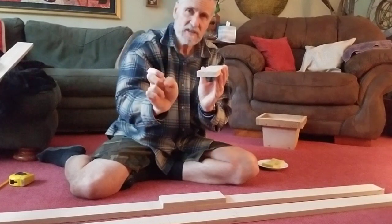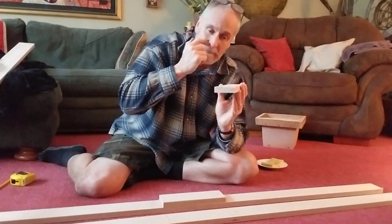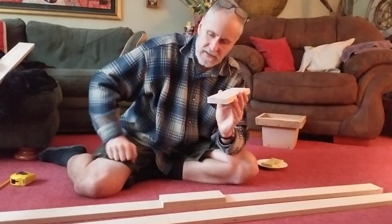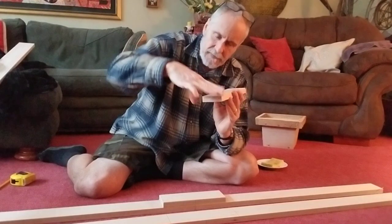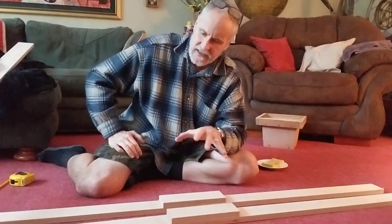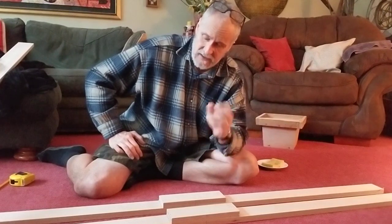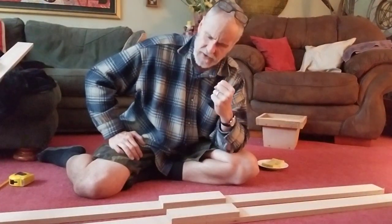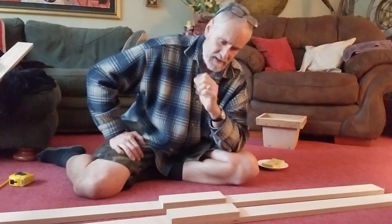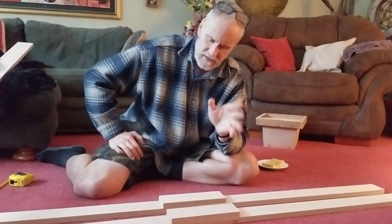For a bow that has great changes in widths — and I'm going to talk about the talisman I owe somebody — it's a little too high in the angle for that. But you could cover up a lot of differences in growth rings. I'm not going to say mistakes or errors, because it's not a problem. These will make nice stiff bows, and I'm going to aim for 50 to 55 pounds, maybe this side of 60, because this wood could support it.